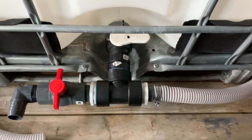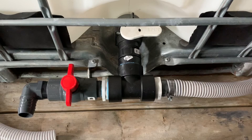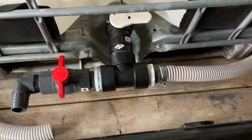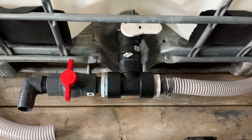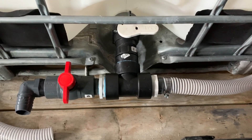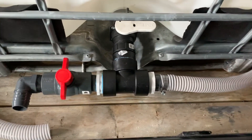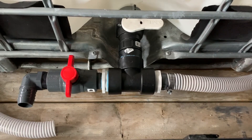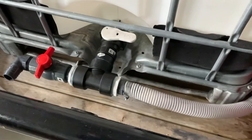Some of you may have questions about it coming out of the tank and being a 90-degree turn. You may even give me a thumbs down on my video because you don't like the way that it's plumbed, but I will tell you this: it's two inches coming out of the tank, it's two inches going around the turn, and it's 1.5 crush proof tubing all the way to the pressure washer. There's a lot of guys when they're running their eight gallons a minute, they're only using one inch. So having that 90-degree turn with running two inches all the way out down to an inch and a half, it's not going to restrict the flow at all. If you're going to run something three-quarter or one inch or something small coming out of your tank, yeah, definitely you don't want to have 90-degree turns or a bunch of different weird turns coming down to your pressure washer. But with this being as big as it is, it's not going to cause any problems.